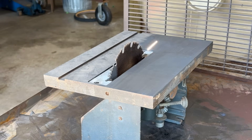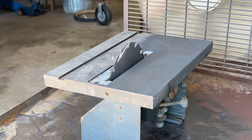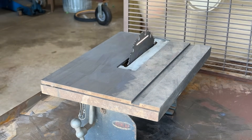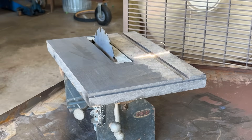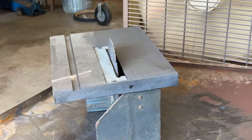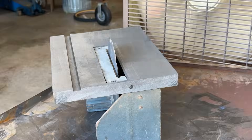I did learn something new here. Once I cleaned the surface with the pulsed laser, I couldn't re-clean that area with the continuous wave laser to achieve the darker, less pitted surface. However, the etching lines left from the continuous wave cleaning at 80 hertz were removed when I went back over with the hertz setting changed to 100. If you have any questions on these machines, let me know in the comments and as always, thanks for watching. I'll see you next time.